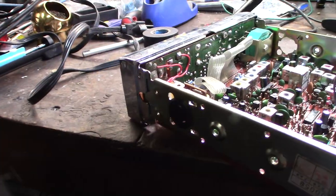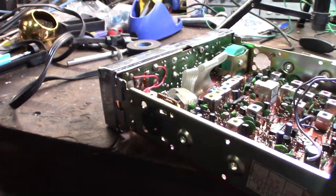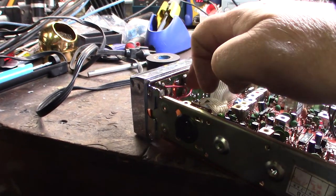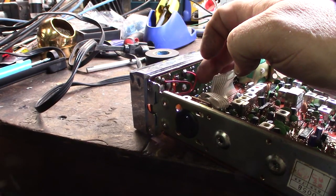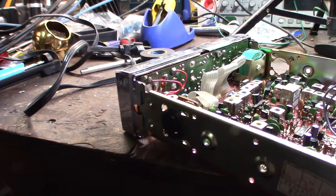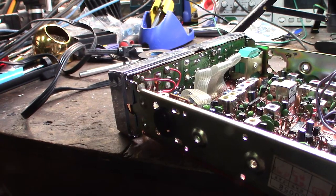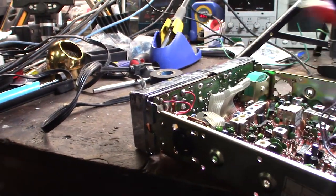All right, so I'm going to swap the light out for an LED. Looks like I'm just going to take a couple screws off. Not very difficult, but because both these wires are the same color, you need to find the polarity of the LED, or find the polarity here. With an incandescent bulb, it doesn't really matter what the polarity is, but with an LED, it's polarity specific. I'm going to use my multimeter probe and figure out which side is positive and which side is negative.